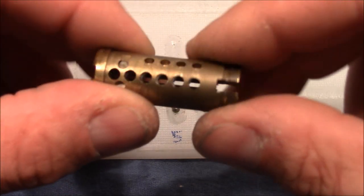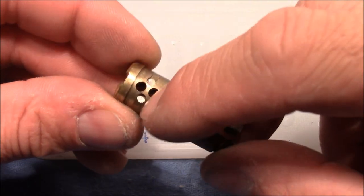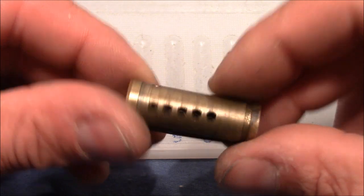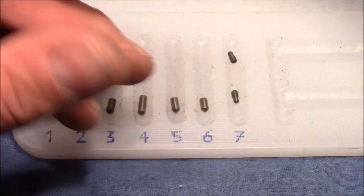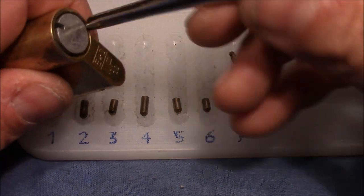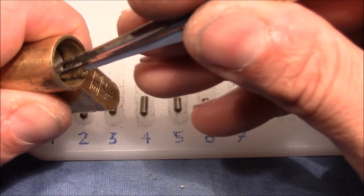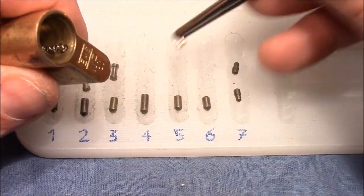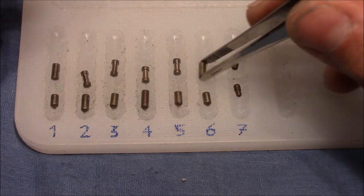From the plug we see the six chambers for the active pins, the two anti-drill pins, and the holes for the key control pins, plus some other little holes — not sure what those are for. Let's check the driver pins: one is a standard, two is a spool — that's surprising — three is a spool — all spools! Wow. And the last is also a standard.